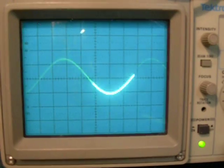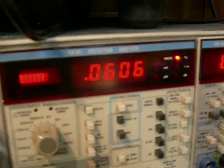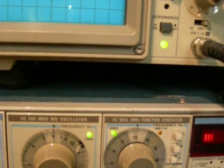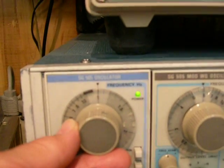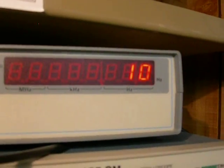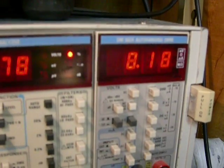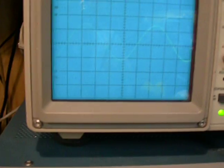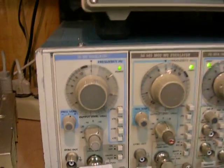Let's see where it falls apart. We'll watch the oscilloscope at 15 hertz — 0.06% distortion at 8 watts. 8 volts across 8 ohms is 8 watts. It does really good at the low frequencies. The lowest this oscillator will go is 10 hertz. Settling in at 10 hertz — that is a slow sine wave. Power response still excellent — still got 8 watts at the same input, less than 1% distortion at 10 hertz. That's pretty good for a probably 60-year-old amplifier.